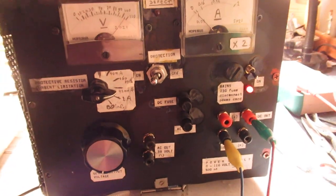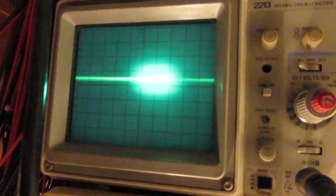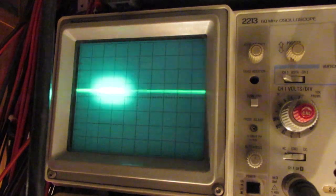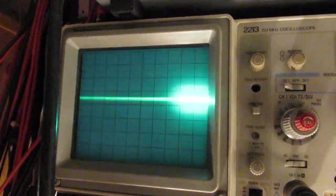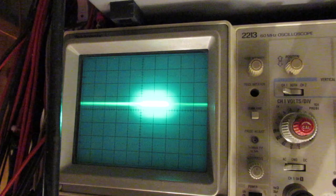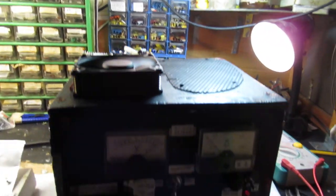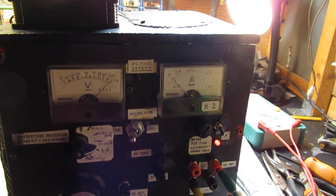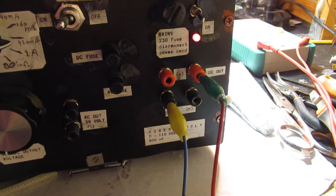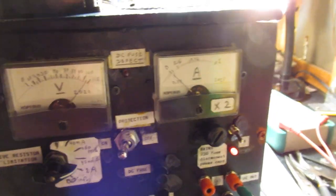And so also interesting is this, that I will give the output on the oscilloscope. And of course when the current gets high and say a smoothing capacitor, the smoothing effect of the circuit is not ideal, you will see the ripple. And I've used a voltage doubler in this power supply that also has an effect on the end ripple, and of course that ripple that's present on the output also is directly related to the current that the circuit gives.